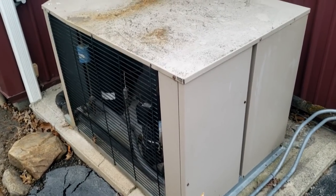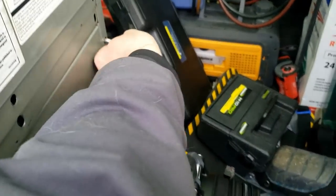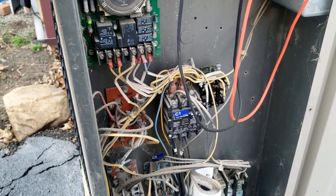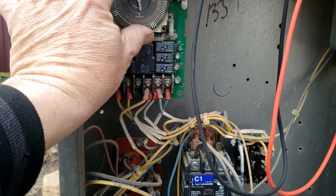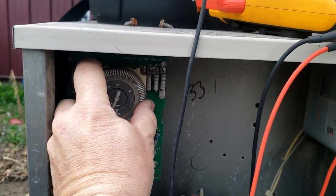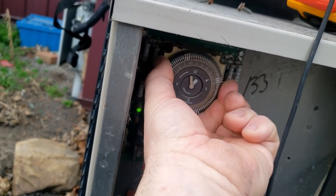It's got its final resting place here because it doesn't like to sit still — got to be seat-belted in. I just went inside and checked the evaporator section: it's not running. You can hear the solenoid, the heaters are not on. Looks like we're in defrost possibly. Let's rotate our clock, which is not wanting to turn at all. Holy crap, that clock is jacked.